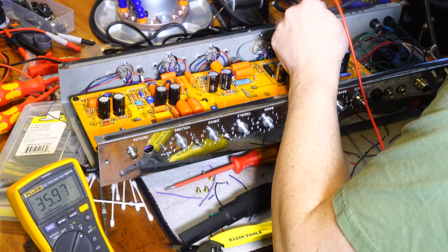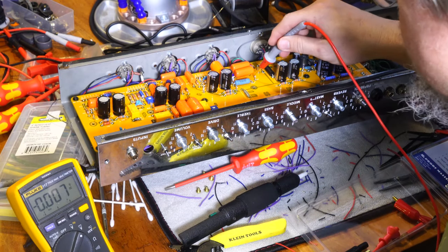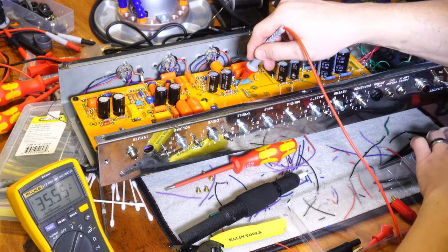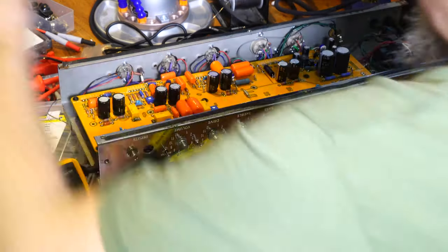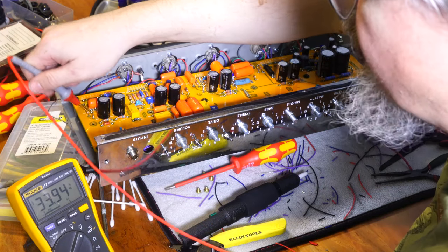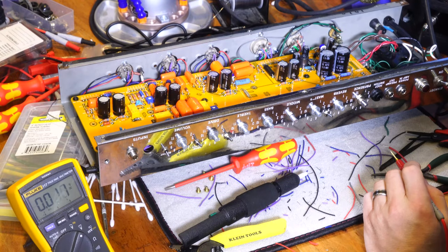So I've got 35 volts DC coming through. If I go to my power supply nodes, for example, 35 there. Oh, this is in the way. 35 there. Let's get this out of the way. I'm just trying to see that we're getting the voltages we should be expecting in all these places. 33 volts at the end of the thing. Now, there's no tubes, so it won't be dropping voltage, but I just wanted to make sure everything looks semi-decent,